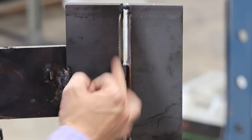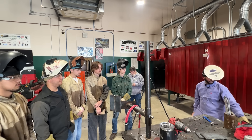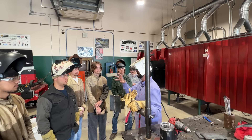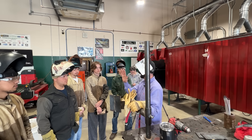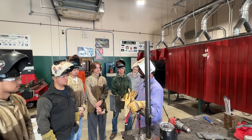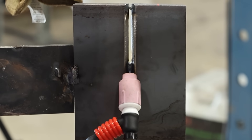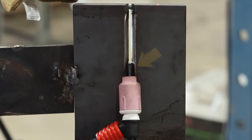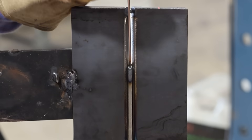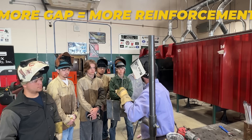See that pretty gold color? That coloration comes from a nice consistent travel speed. On this machine I'm sticking straight to 125 amps — I wasn't in any hurry. I'm watching the puddle; the puddle's got to sink. If it's lumpy, I'm not moving forward until I see that puddle and wire sink into the groove. If it's not sinking, go slower or turn the heat up. To keep your wire in the puddle, maintain your arc length with the tungsten pointing in. If you lean back, the wire runs away and balls up, dropping bombs into your weld.